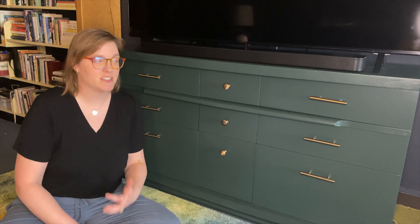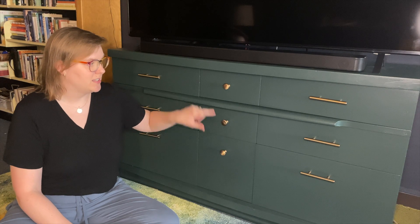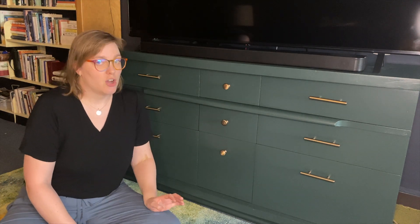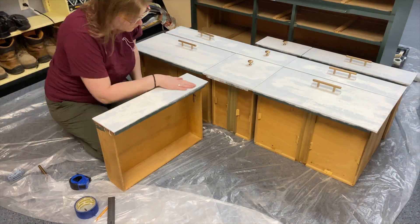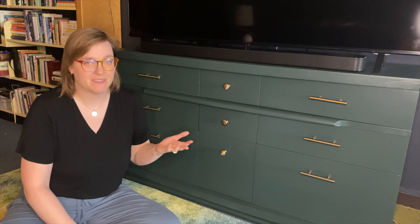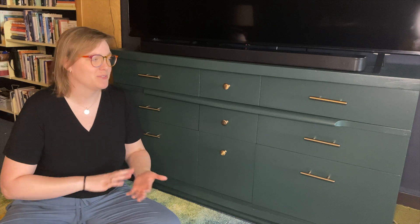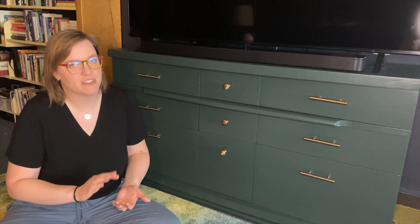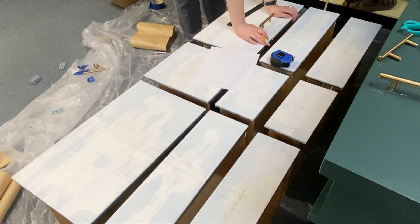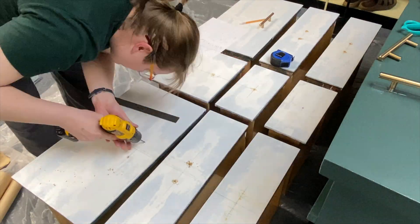Once the drawers were primed again, I started to map out where the handles were going to go. I bought all the hardware from my local hardware store — I decided to use knobs on the middle drawers and handles on the side drawers in a brass satin finish. I measured and re-measured, but even so I drilled a couple holes in the wrong places, so I had to go back with the water putty and fill those in. I was a little frustrated, but they were small holes so I was able to hand sand those down. Then I triple measured, drilled all the pilot holes for the hardware, and used a little sandpaper to smooth around the edges of the drilled holes.